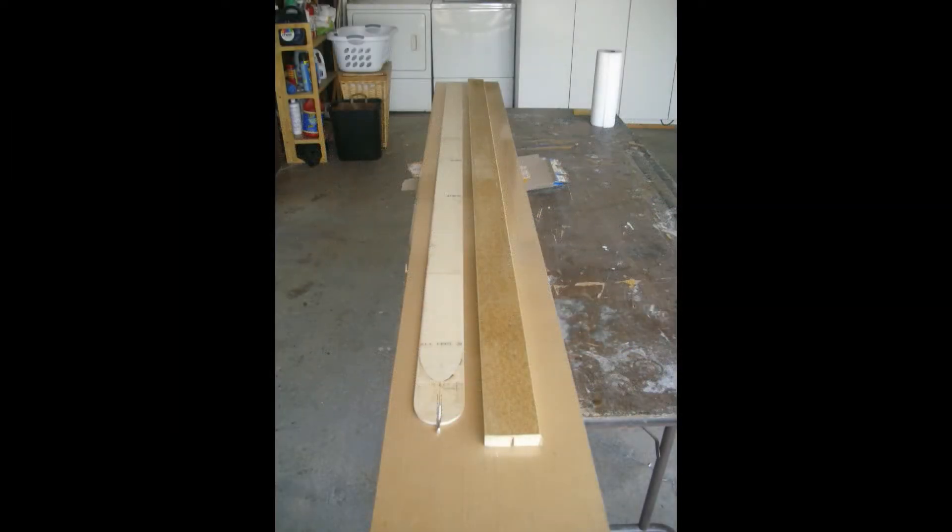The first photo shows the foam and plywood core for the rear spar. The foam is quarter-inch thick, six pound per cubic foot Divinycell. Aircraft plywood is used at the root end only and provides a solid core for support of the alignment pin and attachment bolt. Carbon fiber fabric is placed around the core and molded to create a C-shaped section with the flanges integral with the shear webs. The spar is formed on an inexpensive male mold constructed of one-by-twos and a face sheet of high-density particle board with a smooth glossy finish on one side. This mold is covered in packing tape and then sprayed with mold release to ensure a clean release of the parts. All of these materials are available at large hardware stores like Home Depot. The construction surface is a piece of countertop material that has a Formica surface that provides good mold release.